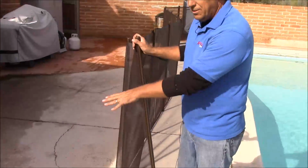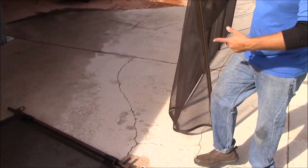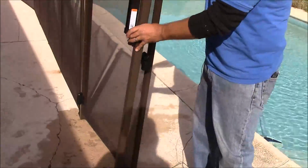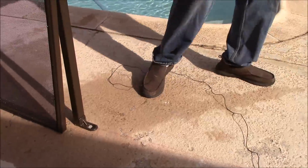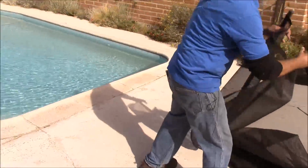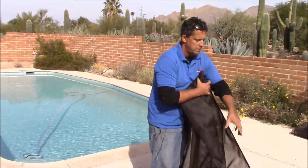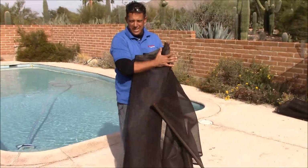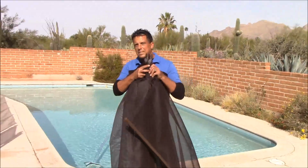When you get to the gate, there's a plate on the bottom of the gate post, so the gate posts do have to go up before the panel. Again, I'm not going to bother latching the gate until we're done with the rest of the fence. Each regular section is 15 foot or 6 poles spaced at 36 inches each.